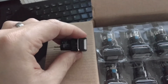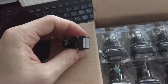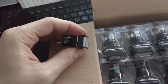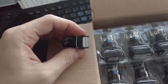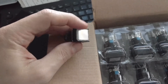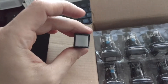That's actually what we want because the Embraer actually has the same latching in and out for different switches. I'm going to use these latching ones for the buttons that will actually be active in the cockpit. There are some buttons that aren't really modeled in FSX, Prepar3D, or any of those simulators — the Embraer models available don't model all the buttons and functionality. So I'll use the latching ones on buttons that are active, and the old momentary ones on the others, just as basically little dummies.